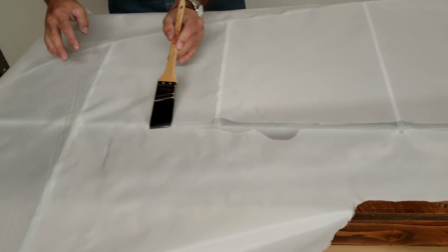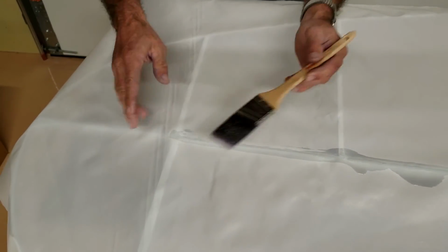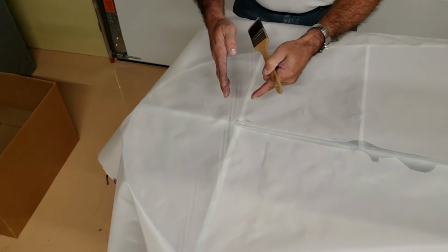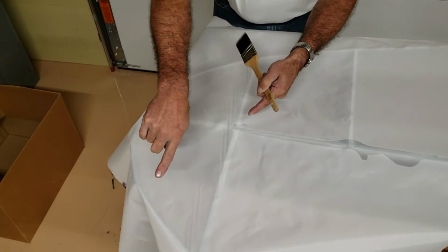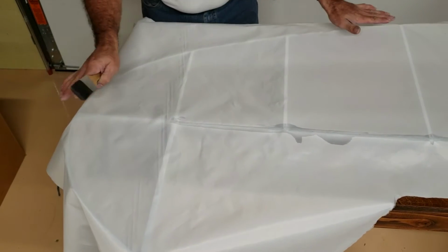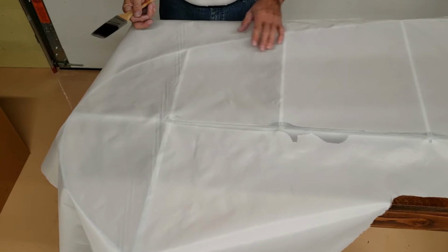But on this part, just as long as you're wetting through, and you can see the little ripple, I like to work down to one end. One thing right here, you'll really see it on a full wing, coming up to the aileron bay, and especially on a J3 where you've got the trailing edge sticking out or the tip sticking out. That whole fabric hanging there will try to hang down, and it'll pull weird puckers, and we'll get into that doing a wing on how to square a wing out and where to clamp it and how to do certain things.